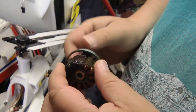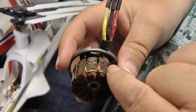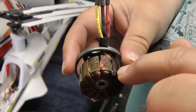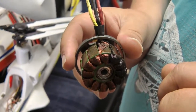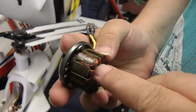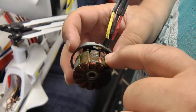Have a closer look at it. Look at this winding — it's popped out, or possibly never been in where it should have been. As you can see it's got rubbed by the magnets. I call that a manufacturing fault. I don't know what everybody else thinks, but that was probably the cause of this phase going bang. All the other phases haven't got hot. So I say that was a fail — it shorted out, and Bob's your uncle.